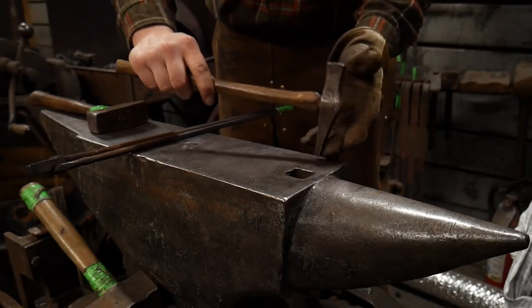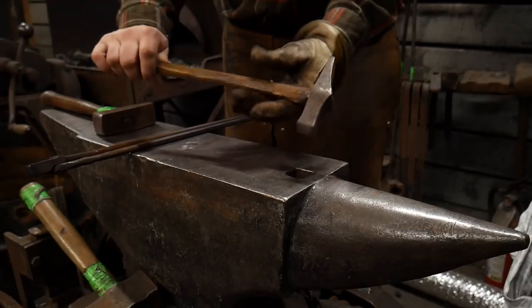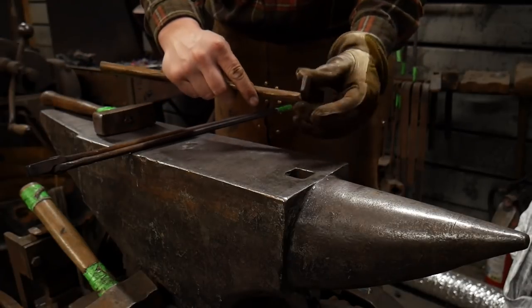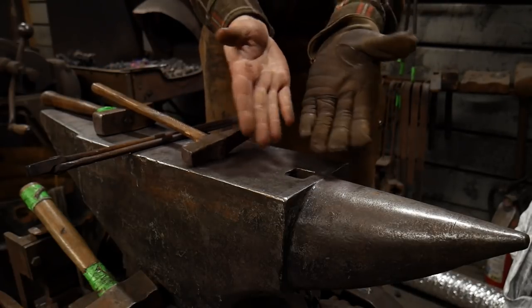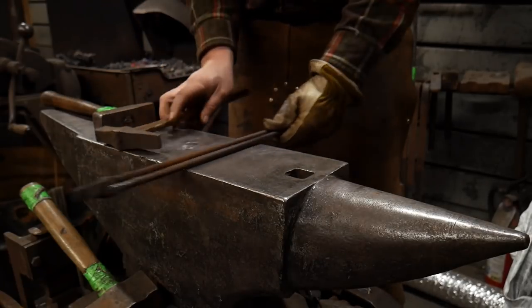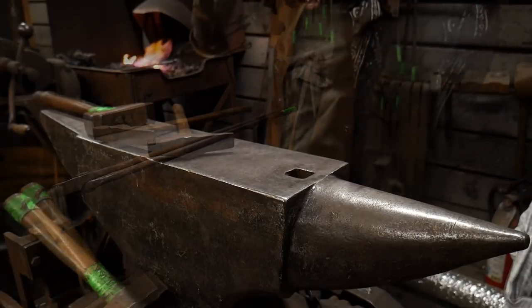Real quick, I just wanted to mention — I did switch to using a much smaller, finer cross peen than my larger one. This is where you want to switch to a much lighter and smaller hammer. The tinier the cross peen the better for this type of work. We're just trying to form the piece — we're not really trying to forge the piece or change its cross section. We're trying to form its cross section. So once that's hot, I'll bring it back out.